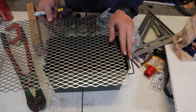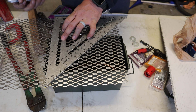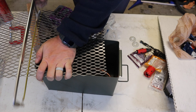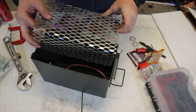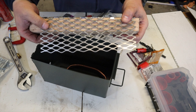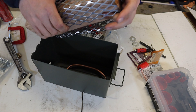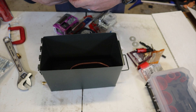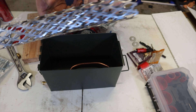Now get out your sheet of expanded metal grating and lay it out. Pick a line to mark so that once we cut it, you'll have about a quarter to a half an inch of room between the sides of the can and your sheet. This can be done with a hacksaw, but a cut-off wheel or a jigsaw with a metal blade would make short work of it — just don't try to use a sawzall, it's not very safe. Once you get it cut, you're going to want to fold it. You want an equal amount off of either side when you initially fold it, which will be about three inches, because you can use a two-by-four to wrap it back around. Essentially, this makes an inch-and-a-half tall riser that will go inside and protect the burner and give it a shelf to put things like lava rocks on top of. Gloves would probably be a good idea here to keep from cutting your hands.